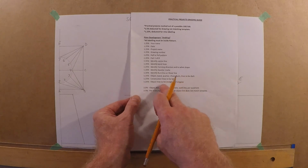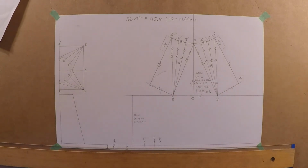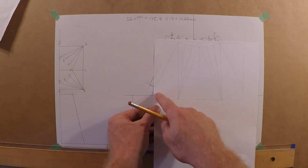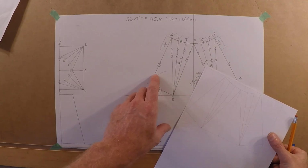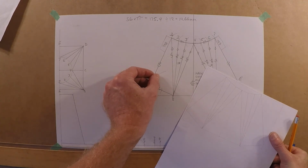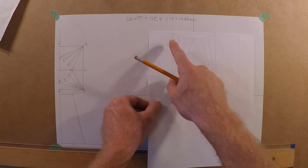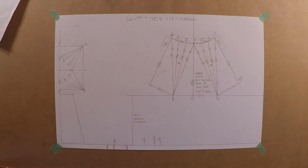Everything's construction lines to be light. Object lines straight and singular. And then object line must match this template here. And again, what we usually try to look for is your line covers this line. So the lines here, generally we're not looking for anything thicker than 1 millimeter. But anyway, make sure that lines up. It's a little joggy on this one. But that looks like it's pretty good. That's a match. Okay, that's drawing 5.